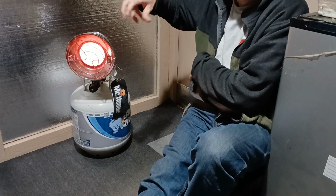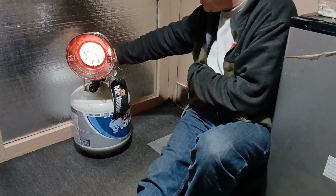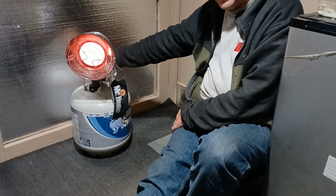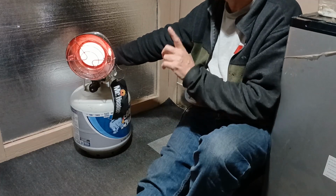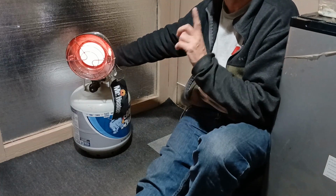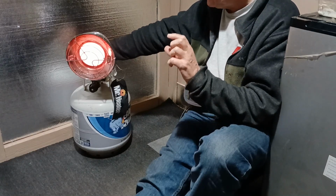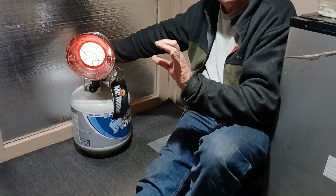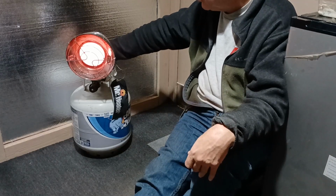Now, there's a little happy medium. You go a little bit too far, it will turn off. So what I recommend is just sitting behind it like I am now and just slowly starting to turn it off. And you're going to listen to the sound, because it's the sound that you're listening for, because that tells you that the airflow combination, just like in a carburetor, it's changing. So we're just going to slowly turn it down.